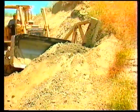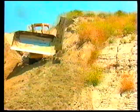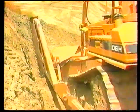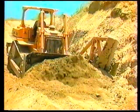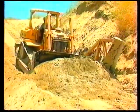It is important to remember that in a pioneering operation, bigger is not always better. In a very steep area, it's usually easier to use a smaller machine that's lighter and will require less footing to maintain stability. It is always more productive to pioneer from the top of the cut and work your way down the hill. That way, gravity will assist you in carrying larger loads of dirt with each pass. However, in steep terrain with no access to the top, this may not be possible.